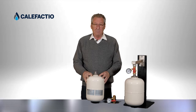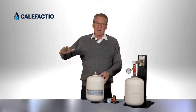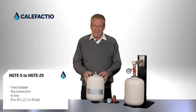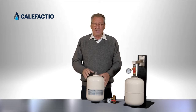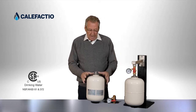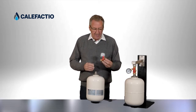They are available in sizes from 2 to 74 gallons. The model HGTEV30 to 200 are the largest ones on a base, and the smaller ones — HGTE5 to HGTE25 — come with a fixed connection. The bladders are CSA-approved for NSF 61 for potable water use, so there is no issue with that.